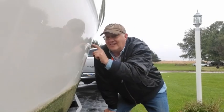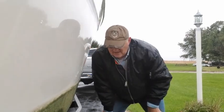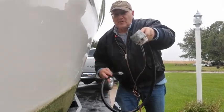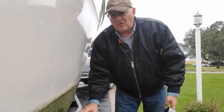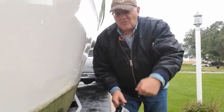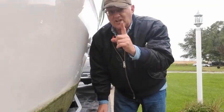If your boat has air conditioning, you need to know where the discharge is — I know mine is the rearward one. I have a bilge pump and a hose. I'm going to hook it up and put a five-gallon bucket of the pink stuff here, but I'm only putting in about a gallon to a gallon and a half. It'll come out the bottom of the boat — we'll go look for that. Let's get the gallon over here and get it going.